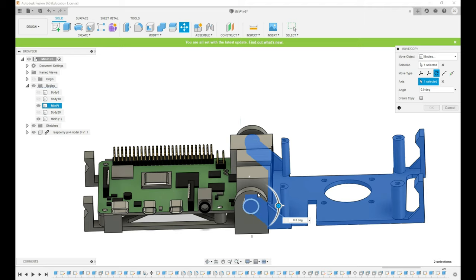When you're designing parts to be 3D printed that have movable print-in-place components, it adds an entire layer of complexity to your design. As you can see from my case design, the right part of the case has parts that print inside the left part of the case. These act as the hinge mechanism, and the trick is that you need to leave enough space between the two components that they aren't permanently fused together during printing, but not so much space that you end up printing spaghetti because it's printing in air.